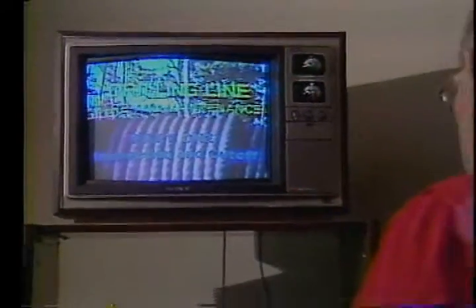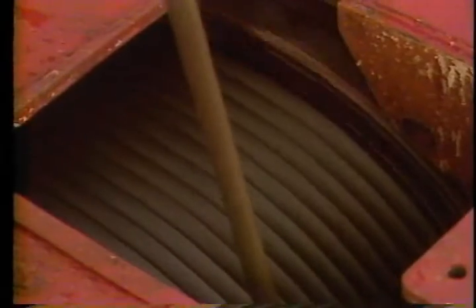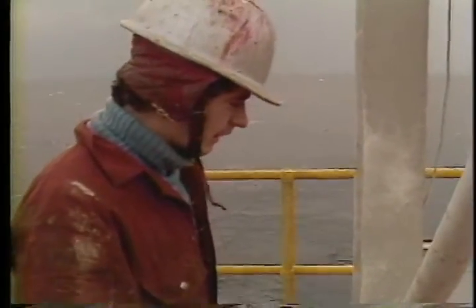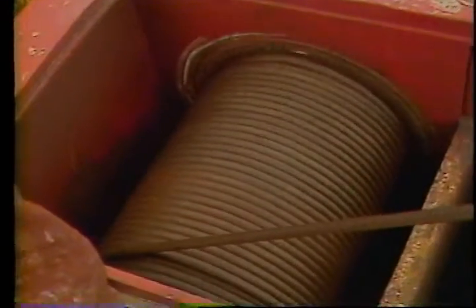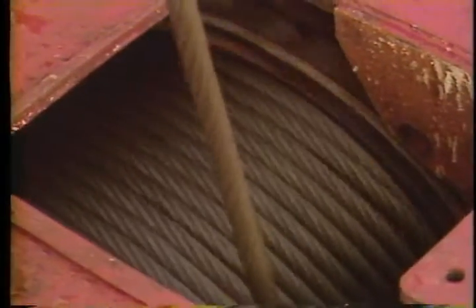You should watch the CEDCO program 'Drilling Line Care and Maintenance Part One,' which you have in your videotape library — it'll give you examples of damaged wire rope and tell you what you can live with as far as damage goes. You want to get a good look at all your running rope; it's going to take a while but can save you in the long run. Also check to make sure all the drums are spooling properly — the wire rope should spool evenly without crossing.